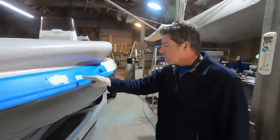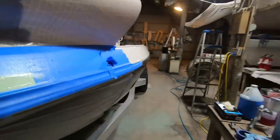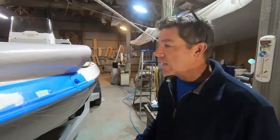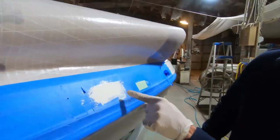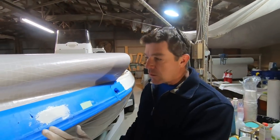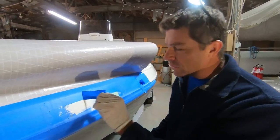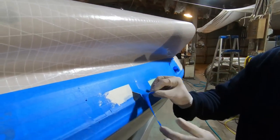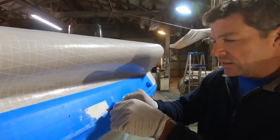We sprayed the PVA and you can see there's a green tint or film on there — that's about all you need. You can go two or three coats and again that's just an option to create an air-inhibiting film. I'm pretty happy with how much fill we've gotten on there. This is what we do for a living — not compromising quality, but we want it to cure overnight. Earlier when we started we did that taping where we left a border around — I'll try to peel that off delicately.